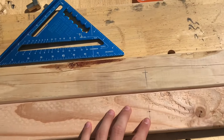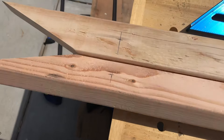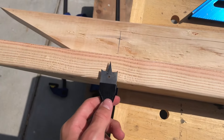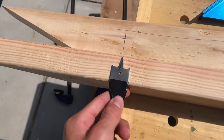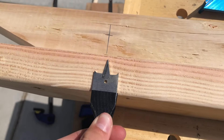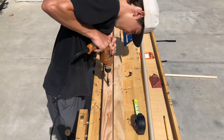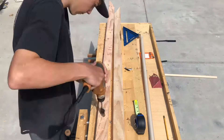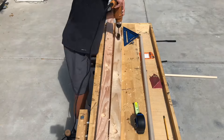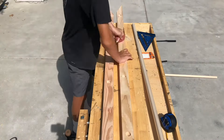Now that all the markings are done, I'm going to drill a 1 inch hole to attach the dowels. I don't want to drill all the way through the wood, so I've marked a stopper on the drill bit so it'll just go in the right depth, and then I'll glue in the dowels. I'm drilling the holes for the dowels, making sure not to go all the way through the 2x3, and then I lightly sanded each hole.